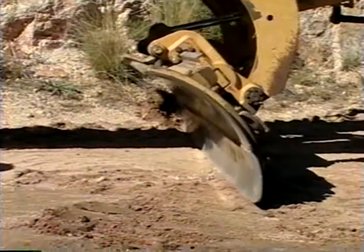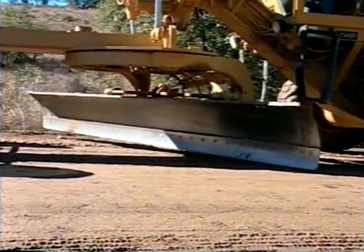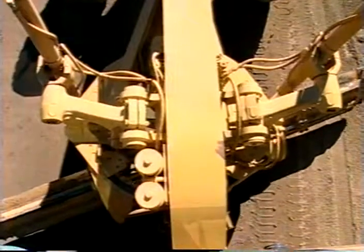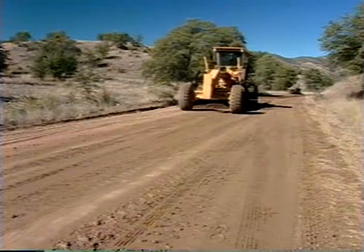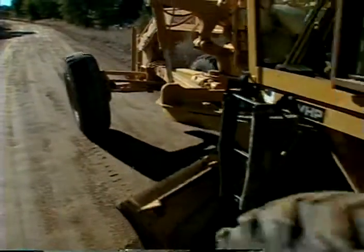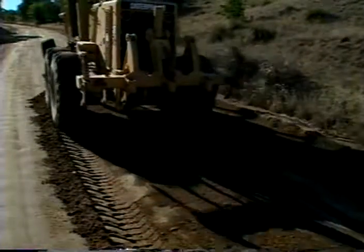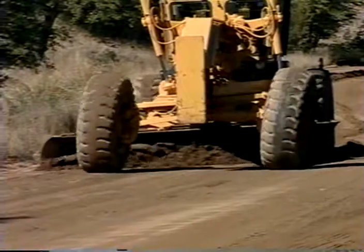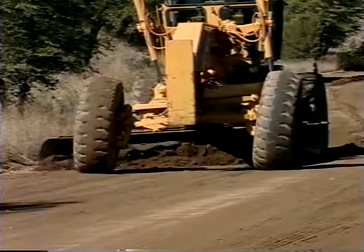Your mold board should be set in a forward position before you begin. Adjust its bottom edge according to the road's template. Angle the mold board to approximately 30 to 45 degrees from the motor grader's axis. Begin smoothing from either edge of the road, applying enough downward pressure to the mold board to allow removal of minor surface imperfections and to release sufficient material to fill shallow potholes or ripples. Adjust the overall angle of the mold board within the 30 to 45 degree range as necessary to maintain a steady amount of material in front of the mold board as you go.